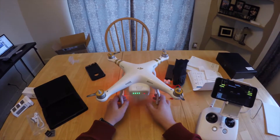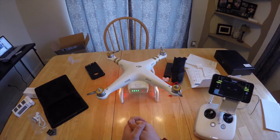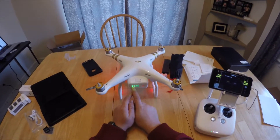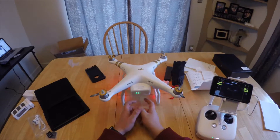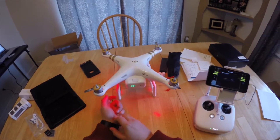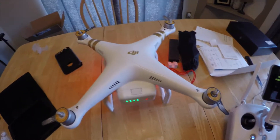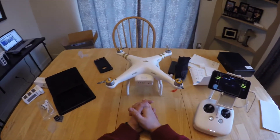You power up the drone, it goes through its own initial setup and orientation, and then it's going to recognize the battery needs to upgrade. You'll hear the gimbal making noise — that's the noise it makes when it starts the upgrade process — and then you'll see the lights change. It takes between two and a half and three minutes to upgrade the firmware on the batteries. If the manufacturer says to upgrade it, upgrade it. This one was already done and took maybe 30 seconds.